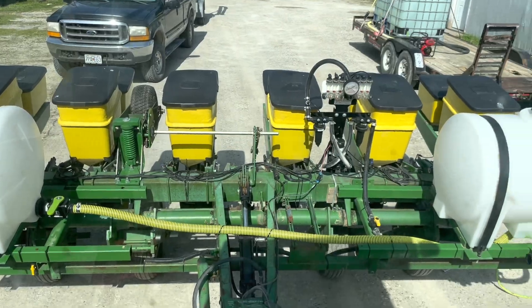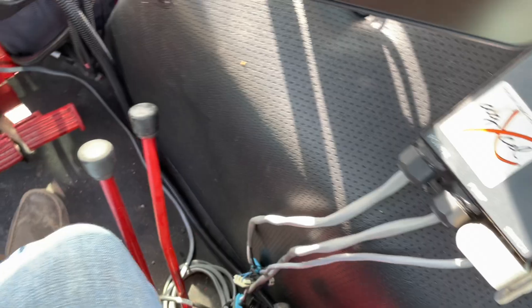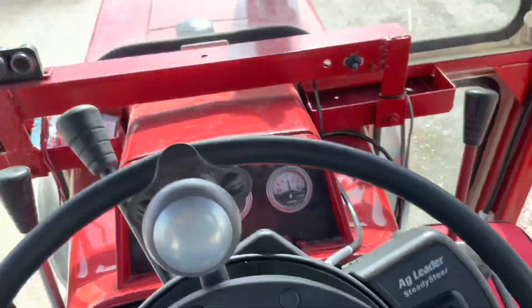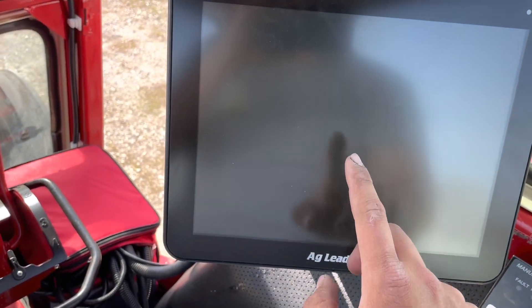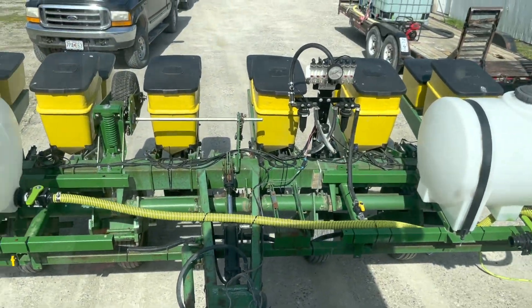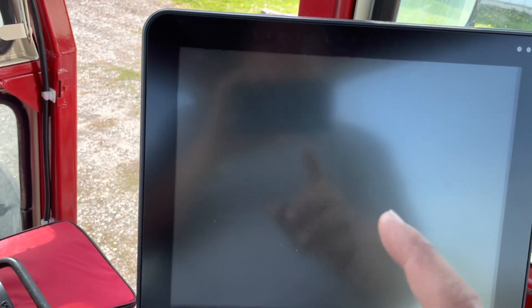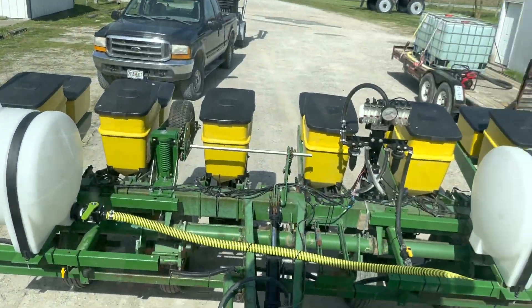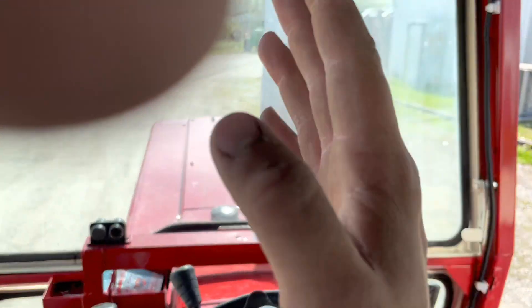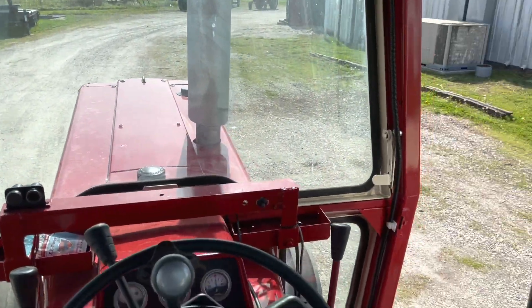We're going to head to the field today and start planting soybeans. David was kind enough to find me a harness that goes from my old planter monitor, which just sat up here and was six blinking dots, and it connects into the 1200. So I'm also going to have seed monitoring — it's not going to run shutoffs or do variable rate, but it's going to tell me if I'm planting or not, if I have skips or doubles. We're going to utilize this for soybeans and popcorn this spring. I'm most excited about popcorn — I want arrow straight rows and we got this thing dialed in. It is driving a perfect AB line.